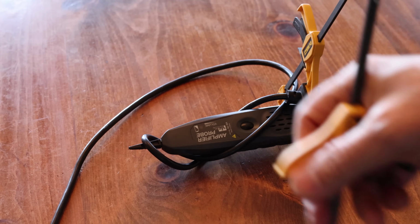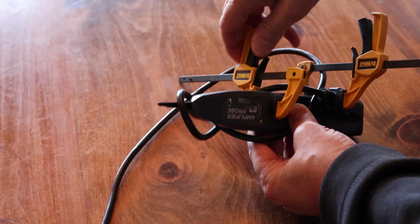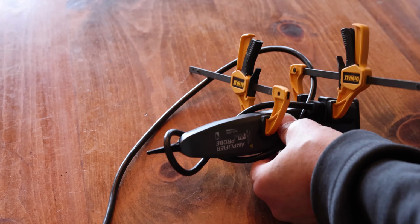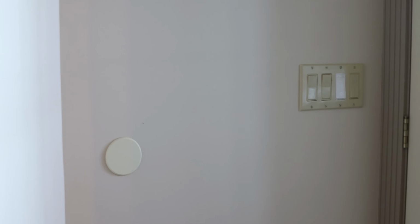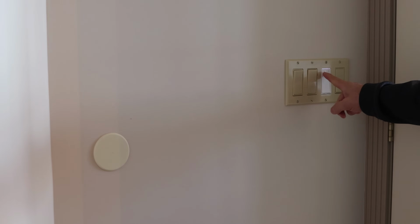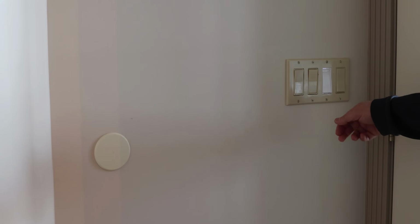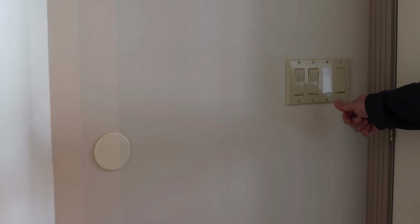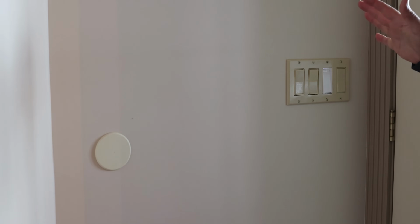So to do this, I'm putting a power cable wrapped around the little probe sniffer. There we go. So we're just going to leave this guy alone here and go back to where the dimmer switch is. It's right here. And again, let's try if it gets worse or not. So as soon as I turn it on, this is full, not so bad. Let's start dimming. So you could see it got worse. That's off, and that's on. So it affects it not as badly, but it's still affected, yet it's on a different line.